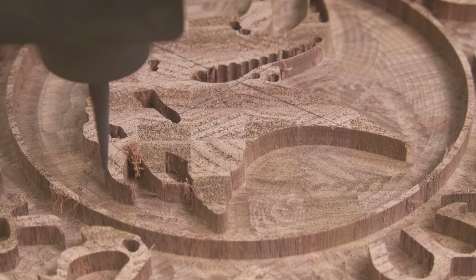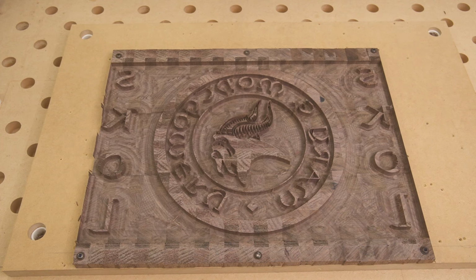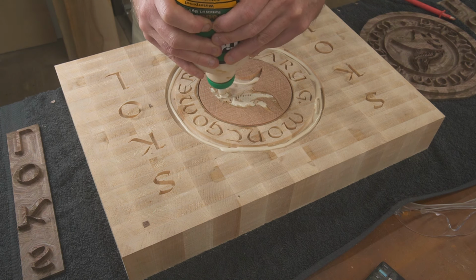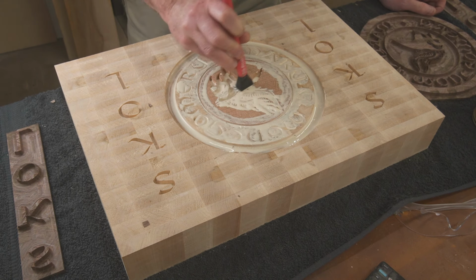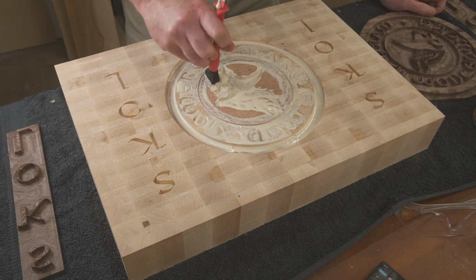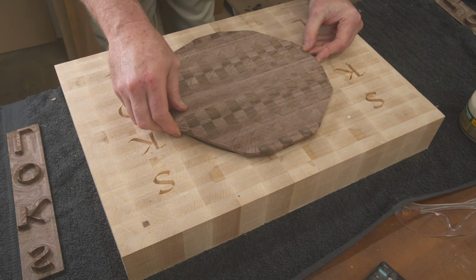So you've got to use the angled bits, the narrow bits like you see here, the 5 and 10-degree bits. And you have to set those as an engraving bit in Vetric. Even though they're sold as tapered ball nose, it's a hack. You got to kind of lie to Vetric a little bit. You got to tell it it's an engraving bit. And it's not Vetric's fault. They didn't design that Vcarve toolpath to do what we're asking it to do, so we have to hack it. And setting it as an engraving bit is the key to that hack.